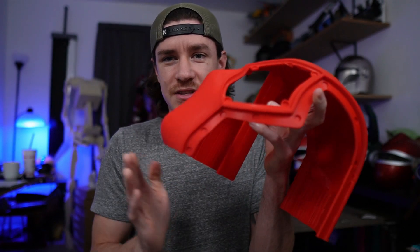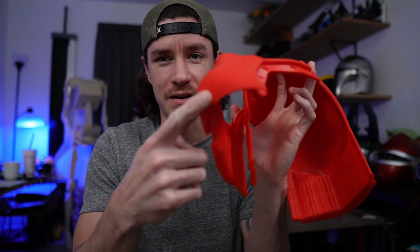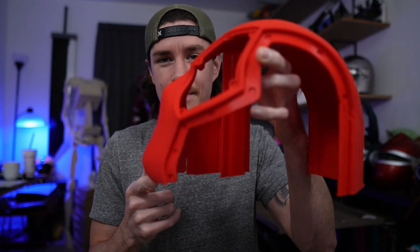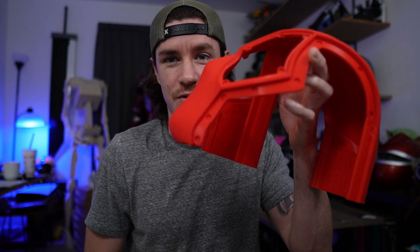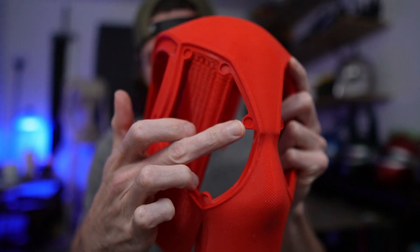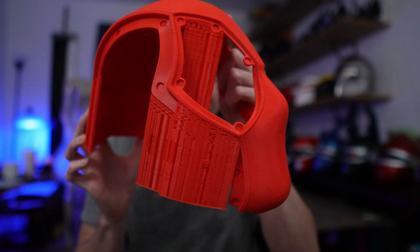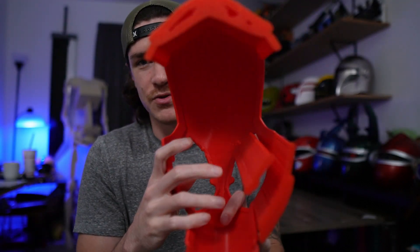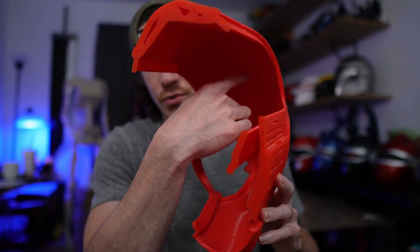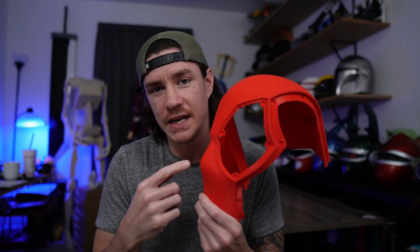What that does is it starts the chin at a better angle. If you have it supported too far up, you're gonna chew up the bottom chin a lot. What you wanna do is rock it back just a tad so that it's flat about here, and that'll allow you to keep this texture nice and smooth. You're gonna wanna catch the magnet tabs here and here to make sure those are supported, because they're gonna try to print into free air. I support underneath the ridge here and also underneath the ridge on the back, doing kind of a double layer there. But you don't have to support the center spot. There usually is one here as well. When printing in this orientation, you'll get a little bit of ringing at the top, where you can see a small texture here.